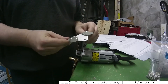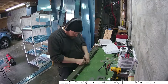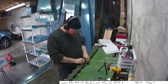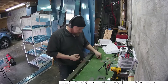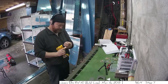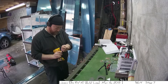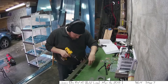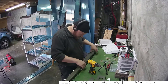Riveted! One incredible disadvantage of priming, which really didn't occur to me until right about here in the video, was that all that match drilling I had done up to this point was now kind of worthless because I have to re-drill to get the little bit of paint out of there — the rivet wouldn't fit through the hole anymore. Before it would, because I had checked that, but after the paint, that just little bit of paint was enough to make it so that I had to re-drill out that hole. So that's just something to keep in mind if you're going to be doing priming.